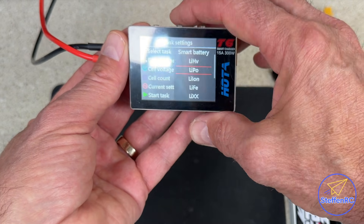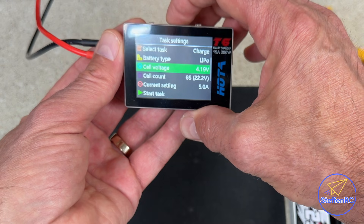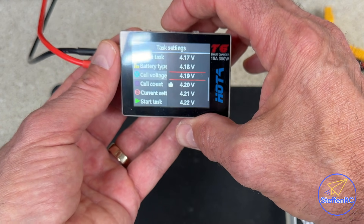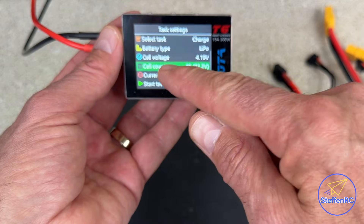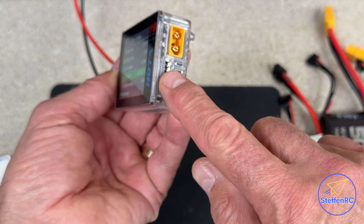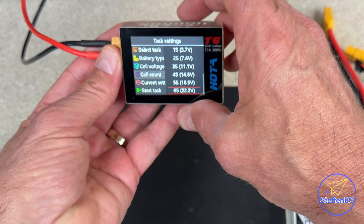What kind of battery do you have? High voltage LiPos, lithium ions, lithium FEs — whatever it might be. Then you set voltage — how much do you want to charge it to. I put it at 4.19V, and then it's automatically going to sense what battery is in it. As soon as I put a battery on the balance port, it's going to know what to do.